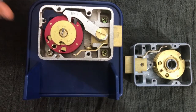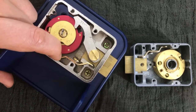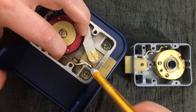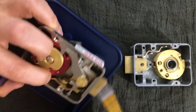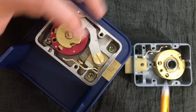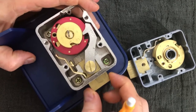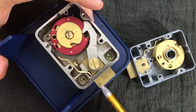The relocker is super simple — it's just a little piece of metal on a spring, so it's always wanting to come down into this closed position. If you look closely you'll see there's a little hole, and this little bit goes into that hole. If the relocker is in the down position, you won't be able to move the bolt — it physically locks the bolt via a pin that goes into the slot in the big bolt.